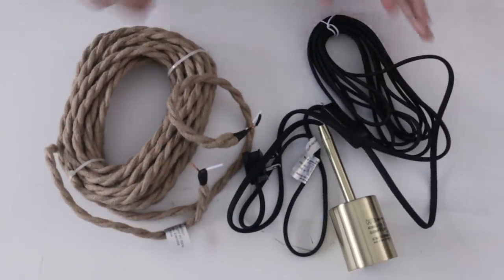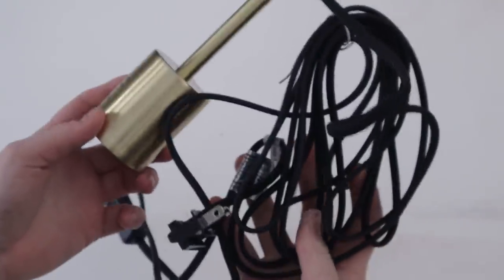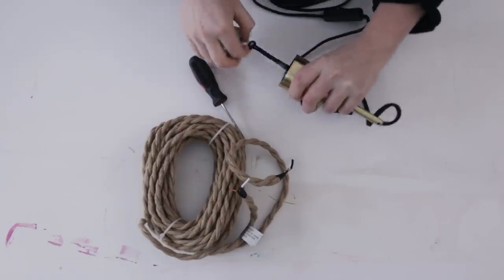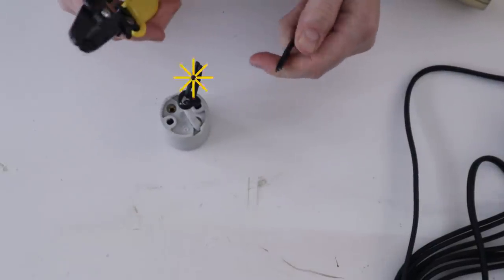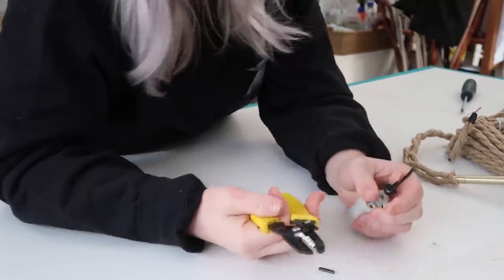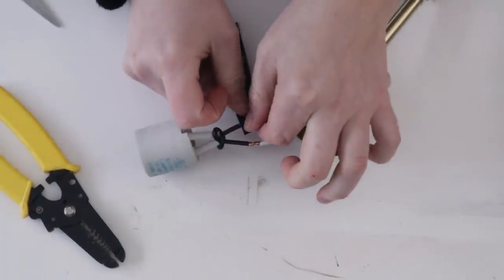Setting all those aside to dry, it's time to get started on the electrifying portion of this DIY. I'm using a plug-in brass finish pendant socket light — sourced for its long metal base at the top — but this light came with a black cord. I didn't want black, so I sourced twisted hemp rope, which meant I had to do a little socket surgery. You just remove the two screws inside the light socket and pull the entire thing out of the brass cage. From there you snip the old black cord right off, leaving about an inch of wire connected to the socket. Taking my hemp cord, I'm pulling back the hemp fabric around the black and white cord and feeding these wires through the brass base. Using wire strippers I removed some black rubber to expose the new copper wire, then twisted the new copper wire from the hemp cord with the old socket wire and used electrical tape to cover it up so no copper wire is exposed. Do this for both the hot and neutral wires.